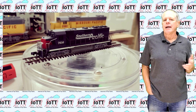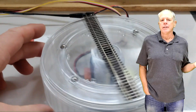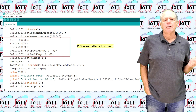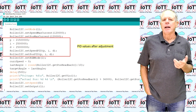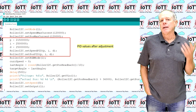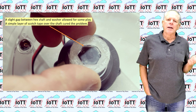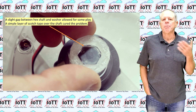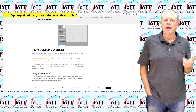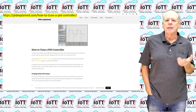So after printing and assembling the turntable, I was ready for testing and at first it was a complete failure. The turntable would barely move and on top of that it had some severe oscillations. The reason was that I did not adjust the PID parameters of the control algorithm to the weight and inertia of the turntable. And on top there was some play between the rotor shaft and the turntable which made proper control basically impossible. So I removed the play and started to adjust the parameters. If you are not familiar with how to adjust PID parameters, there is plenty of information available, for example on this web page here.